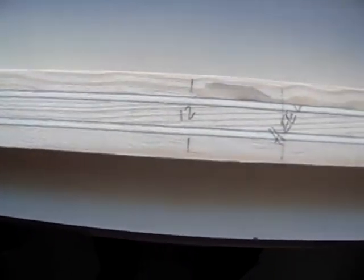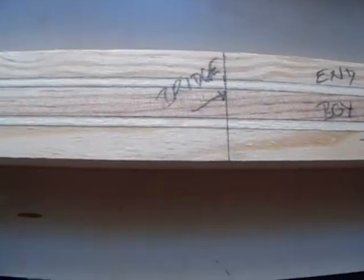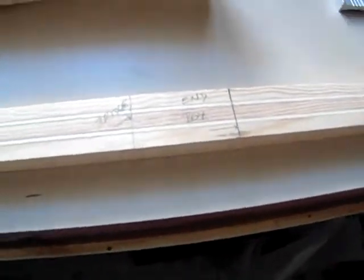We know where the 12th fret's going to be, where the heel is going to be, starting from underneath. The start of the box, 24th fret, roughly where the bridge is, and the end of the box. Then that section there is going to be cut off. And go to this one. And then the edges will be made true, and that piece at the end there will become the heel, as it is on that one, with an insert in between.